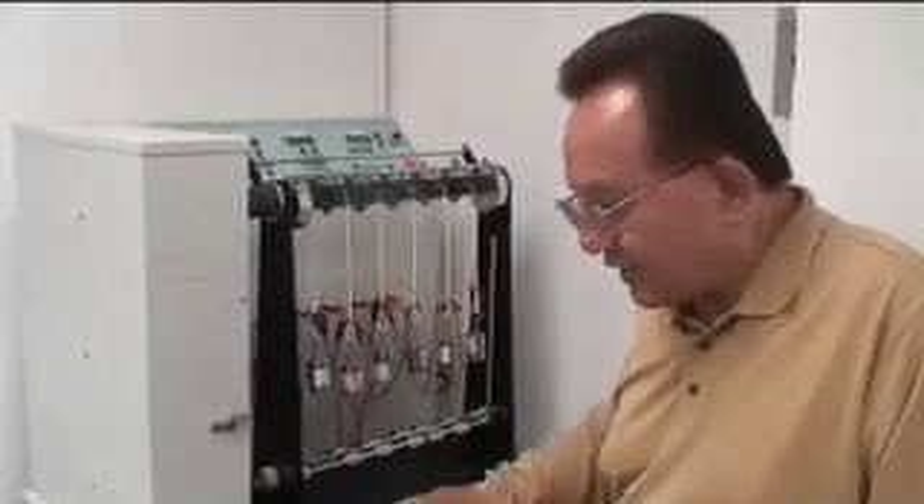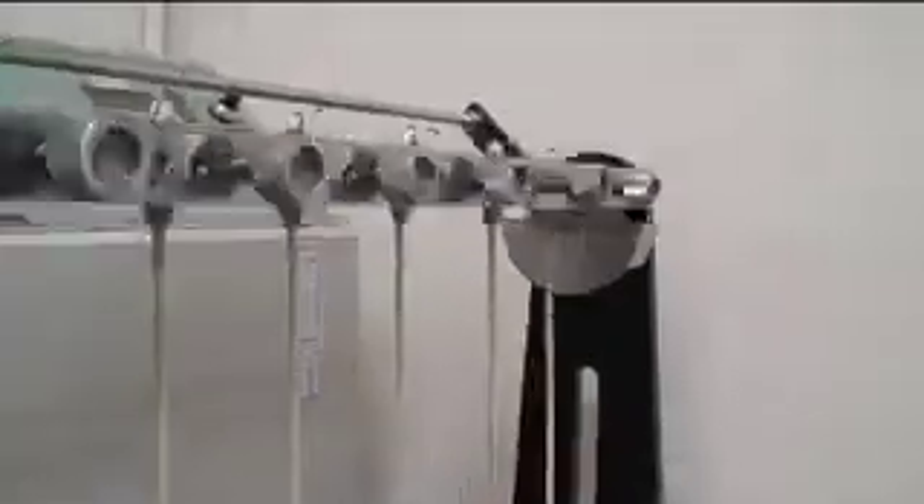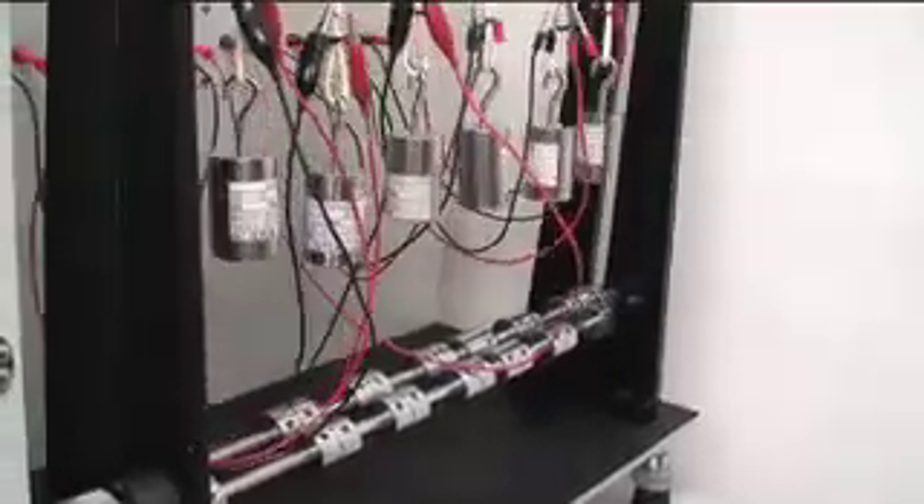These are conductors on the inside, and a 90-degree bend is a severe flexing of the integrity of the connection. You can see there's a prescribed weight and electrodes that measure the continuity, as well as a counter tracking exactly how many times the cable is flexing.